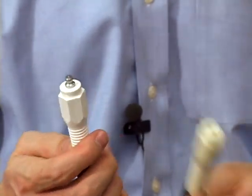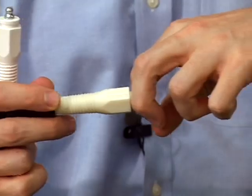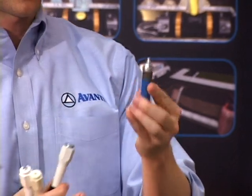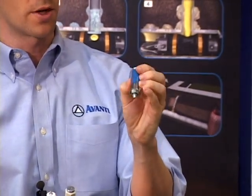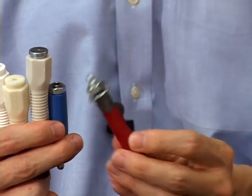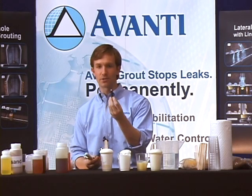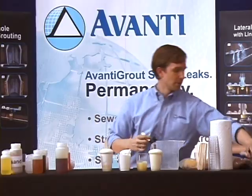We have different injectors. This one has a grease fitting; this one has a button head. I like the button head because as the coupler slides down, it locks against it and can't pull off, unlike these — although the grease fitting ones are the most popular. We also have a metal button head. These are all five-eighths inch. The metal ones with rubber are made for high-pressure injection — as you tighten it, the rubber expands. This is a half-inch high-pressure injection. And lastly, this is a three-eighths inch — just bang it in. It doesn't tighten as you expand it; you just keep your body weight on it. These are the cheapest throwaways, with a little grease fitting on the end. Most people use the grease fittings.